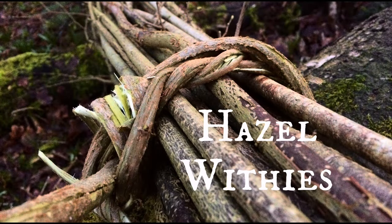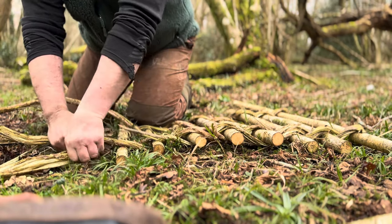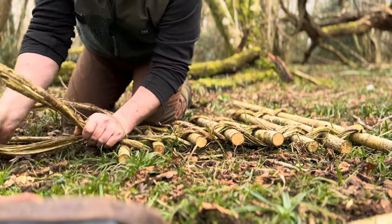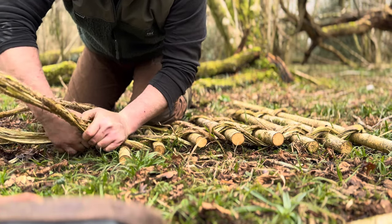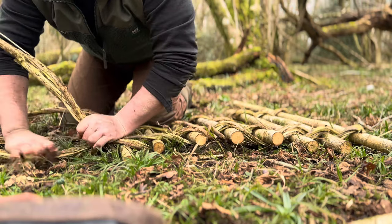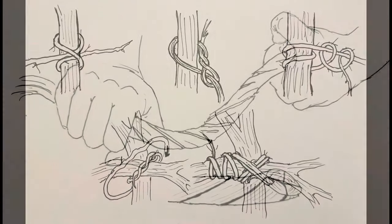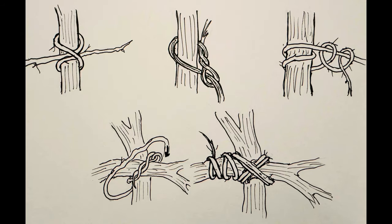Without a drill and other specialist green woodworking tools to make mortise and tenon style joints, I'd need some strong and flexible bindings to lash my hammock style chair together. Young hazel rods can be twisted up into a withy, a process of softening the fibres without breaking or snapping to make an already flexible sapling bendy enough to tie lashings and knots. Basically, a natural and grippy rope.